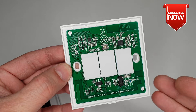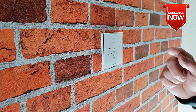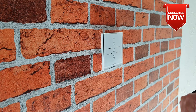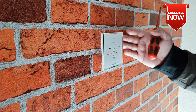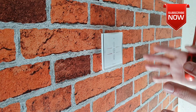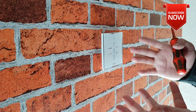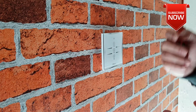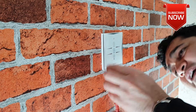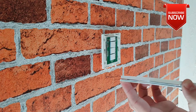Now let's go ahead with the installation process. First thing you must do is turn off your main circuit breaker. Previously I also had a three-channel switch fitted, so all the wiring I need for this Sonoff system is already in place — live, neutral, and three lives going to the light switches. Let's open it up at the base and twist it.